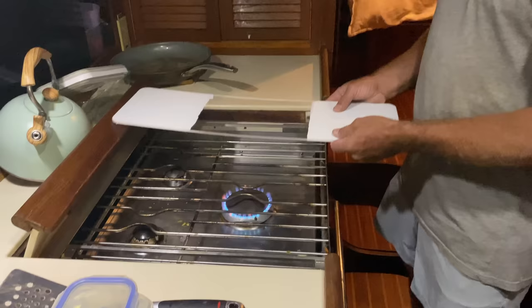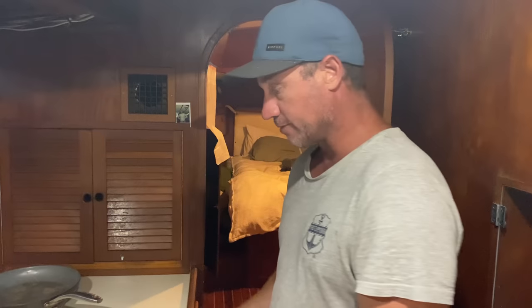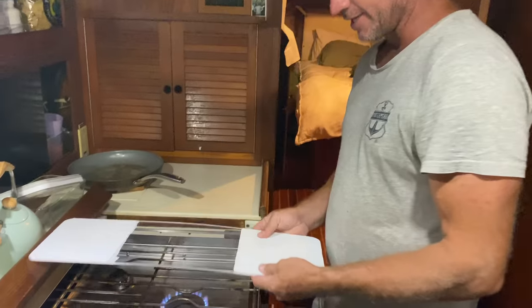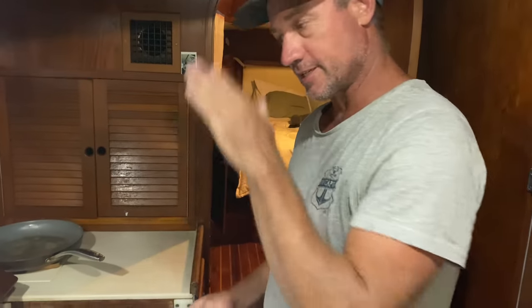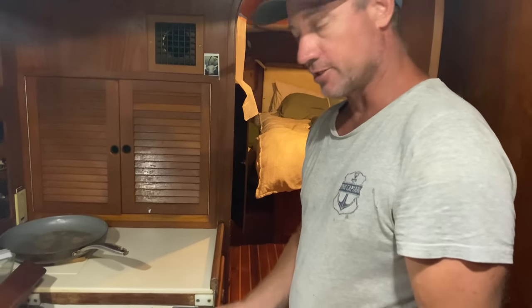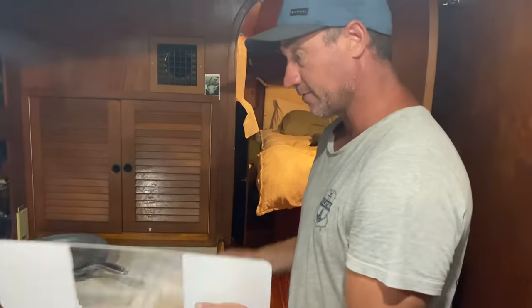Over to you, Dad. All right, guys, not often I get in the kitchen, but there's a pretty big curve on our windows. I'm using some cast acrylic. I'm just massaging the heat over here. I want enough heat so I can just get a gentle curve, because these are just stuck onto the frames. I don't want them to pop off, and it's a slow cure, so I want to get this roughly fitting so I can actually just fit the window.